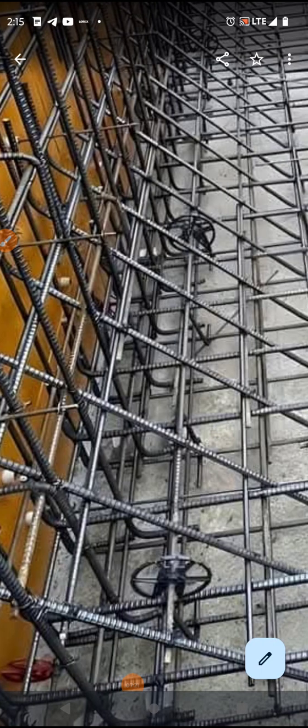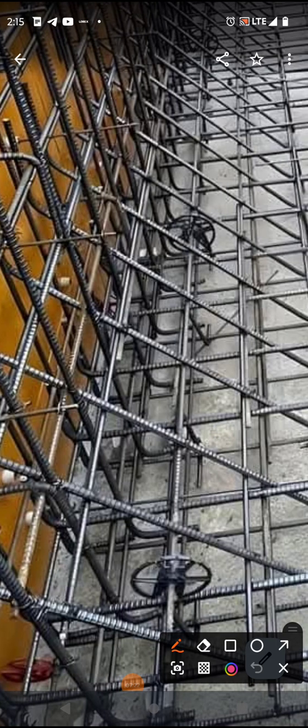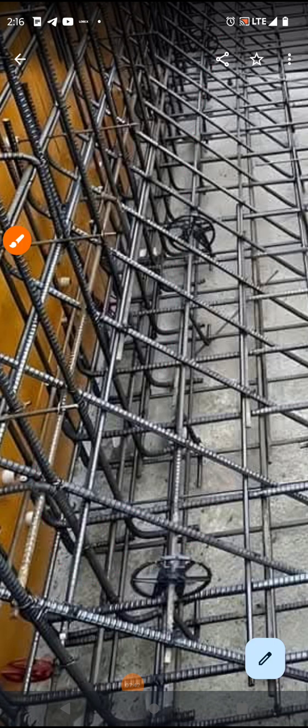If you look to the left, it's actually turned up. They have legs on the bottom of that reinforcement I just talked about that would be in tension. Small legs, little 90s. And it is not doweled. And if you look at the other one behind in the back wall, it's also turned like that, not doweled. And that's consistent all the way down. So no, this does not pass muster as a retaining wall.